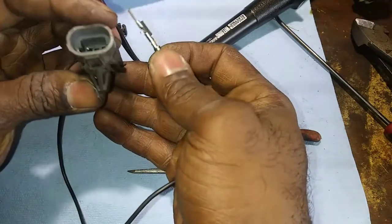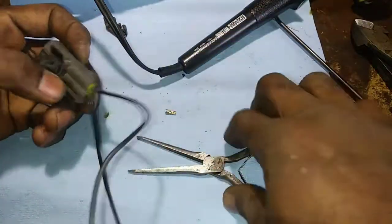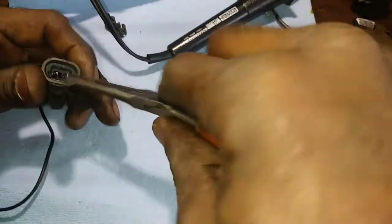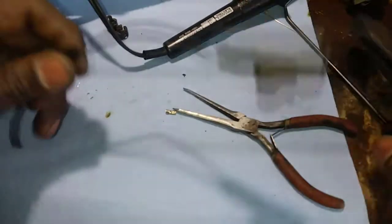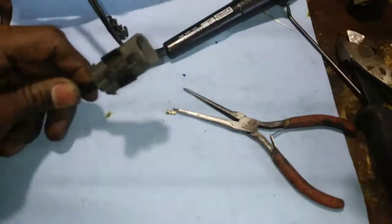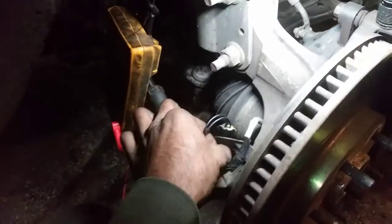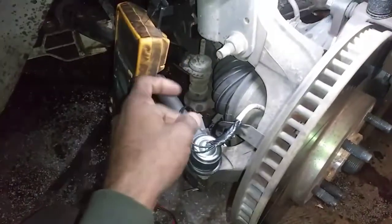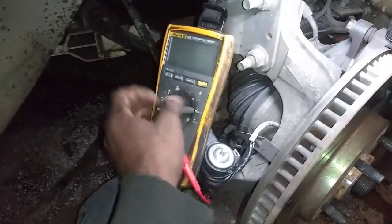I'm going to get that rim back in there. They're both in there and I'm just going to simply cut the wire. Here's my fix — it's just a patch. I got on the phone and forgot to put the insulation around there, so that was my dumb doing. I'm going to do the same test: put my alligator clips inside of here, do a wiggle test, and look at the resistance value to see if there are any changes.